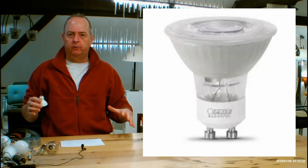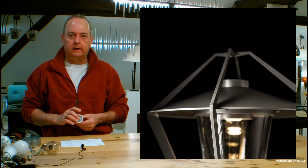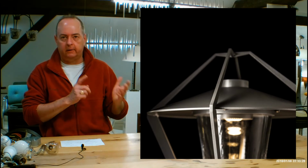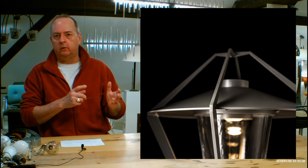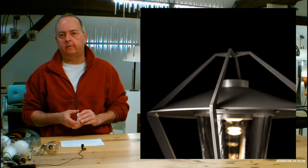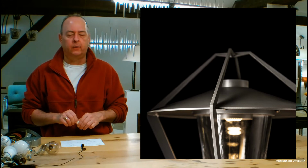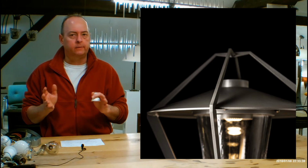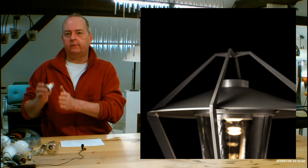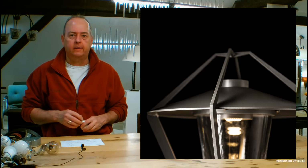This shoots a beautiful beam down. You'll notice when you're looking online that they're going to give you options for 2700 Kelvin, which is 2700 K. That's going to be a super yellow, golden, setting-sun color of light. Way on the other side of that is going to be called daylight, which is a bit of a misnomer. That sounds warm, it's not warm. That's a cool, cold hospital waiting room light. That's 4,000, 5,000, 6,000 Kelvin on that Kelvin scale.